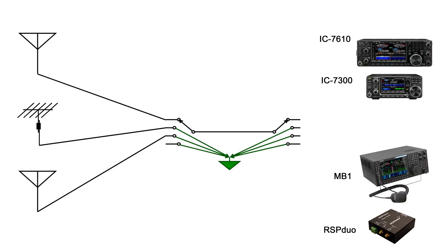So this ensures that I have two layers of protection. No RF can come into the shack — there is no other antenna picking up RF and bringing it into another radio. When not in use, all the antennas are grounded. And when not in use, all the transceivers are grounded as well. This is how I work.